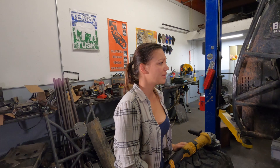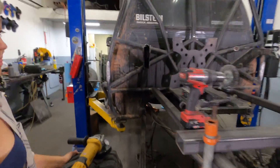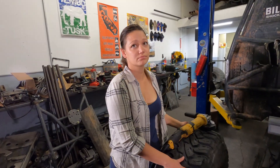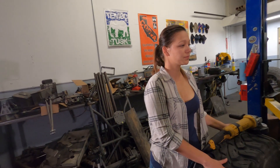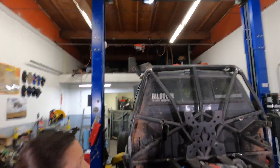Are we going to start basing the roof part off of this before we completely burn it in? Yeah, I just did those welds on the outside because that's the easiest spot to cut off if it isn't square. I'm not going to weld the parts you can't get a cut-off wheel into yet, so I think we should clean up this top part next.